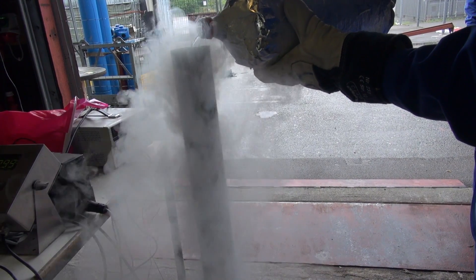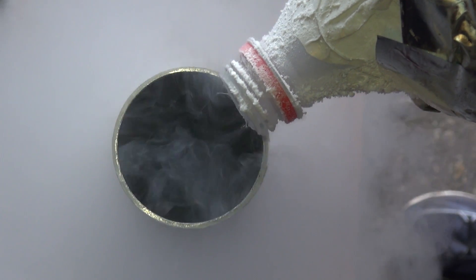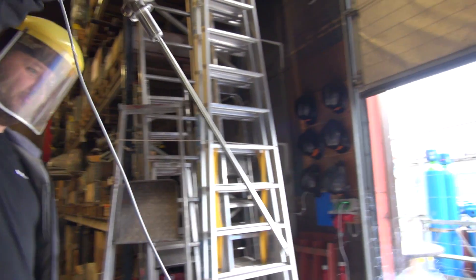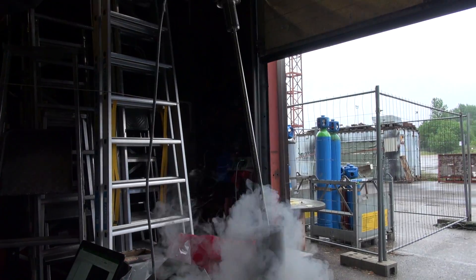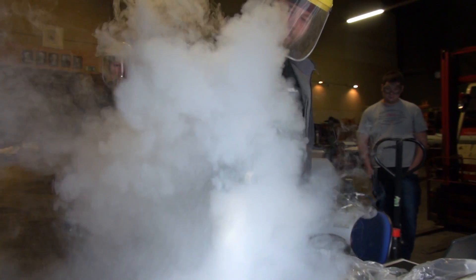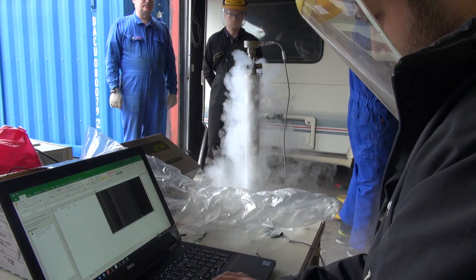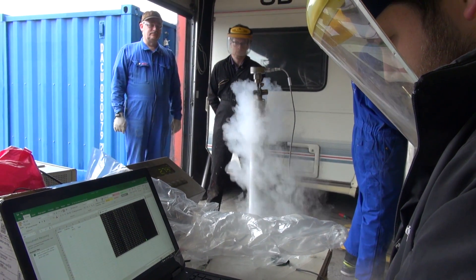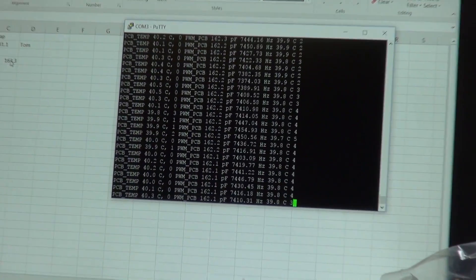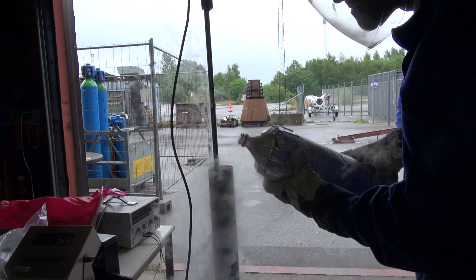Liquid oxygen is one of our propellants — it's our oxidizer, and it's a cryogenic oxidizer, hovering around 90 Kelvin or minus 182 degrees Celsius. It is extremely cold and will boil off just from being at ambient pressure and ambient temperatures — it's going to boil off like steam out of a hot pot with water, just from the temperature and pressure under atmospheric conditions. So it has to stay cold, otherwise we can't use it as an oxidizer for a rocket engine.